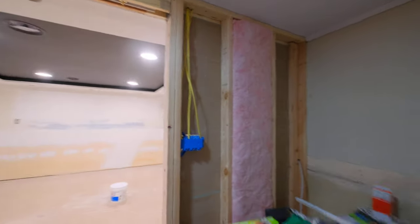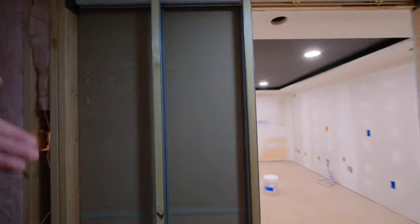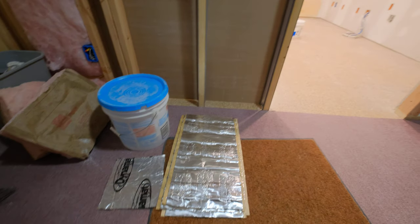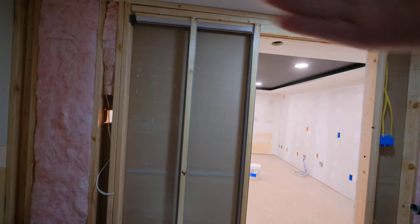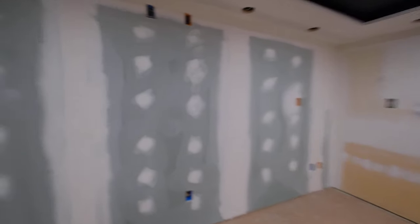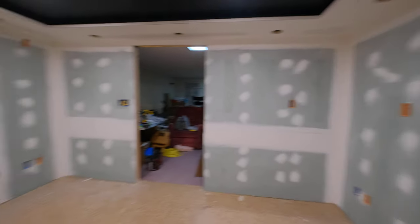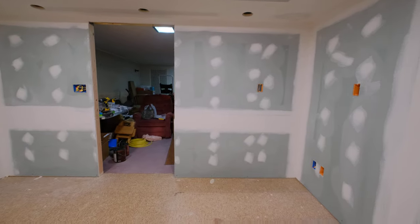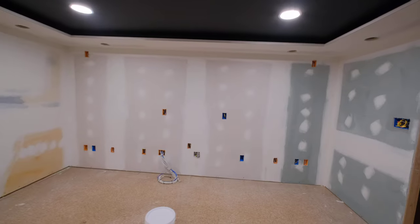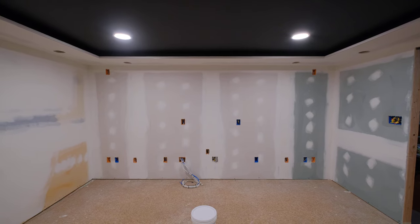All the other walls are two-by-four supported every 16 inches, so it's not as big of an issue, plus they're insulated. This wall is going to be insulated too. You can't insulate a pocket door because the door has to slide in there — it's a big hollow cavity — so I want to dampen that down a little bit. I'm going to stick those Roadkill sheets to the backside since you won't see them inside the wall. I don't know if there's a better idea without doing multiple layers of drywall and gluing in between, which would change the dimension of the soffit. Anyway, thanks for watching — hopefully next time it'll be color. Have a good one!